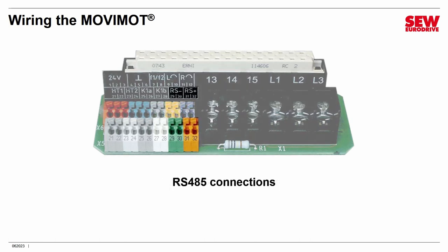We have the RS-485 port here, with just two connectors: RS-plus and RS-minus. You connect this up to a shielded twisted pair cable, and that will go either to one of the SEW accessories — for example the set point adjuster — or to some kind of RS-485 network driven by a bus master like a PLC or a digital controller.